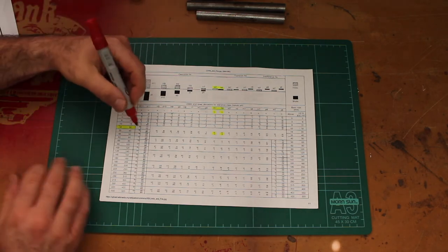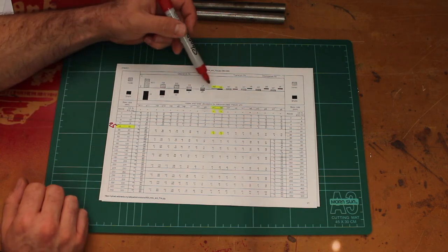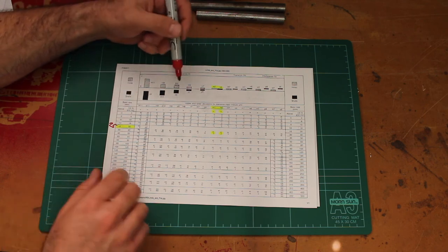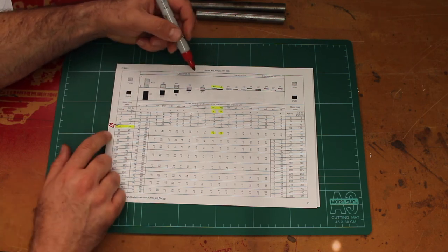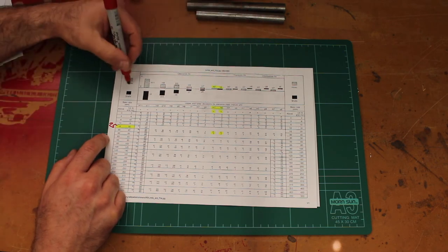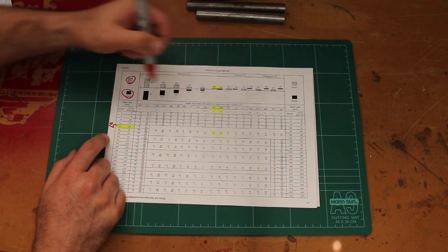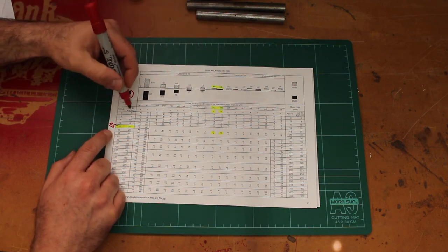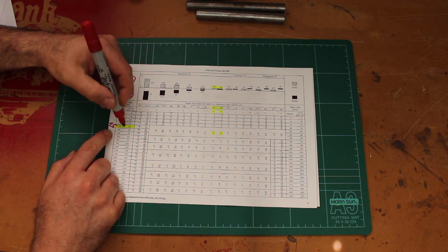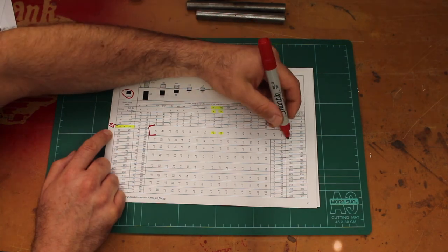But for example, if I wanted to determine a transition fit on a 25 millimeter hole, I'll show you how I read this table. So these are the shaft sizes and these are the hole sizes. So above and up to and including, between 18 and 30. So my 25 mil hole fits in the middle of here. So I need to use this band of the table.